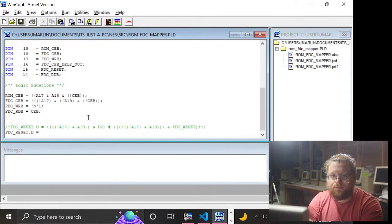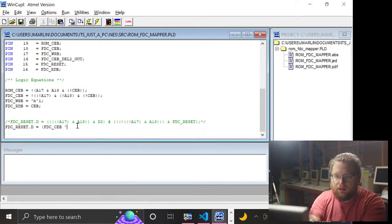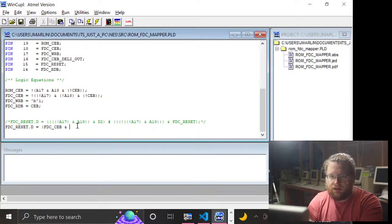So I guess, let me see. It would basically be, this pin's subsequent value will be, if FDC chip enable B is high, then that means it's not asserted, because it's an active low signal. So if that is the case, then it will just be the previous value of FDC reset. And otherwise, if FDC CEB is in fact being decoded, then...